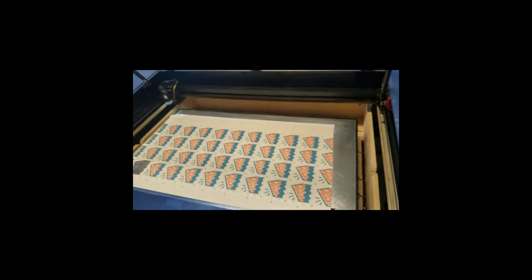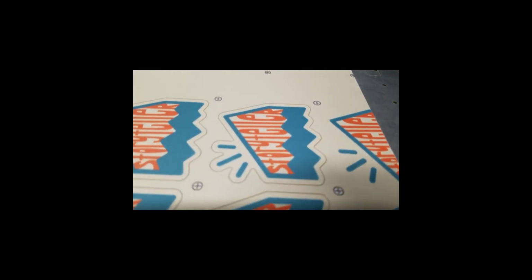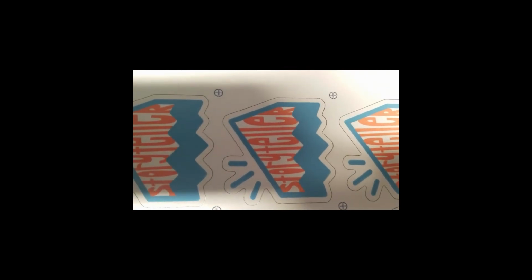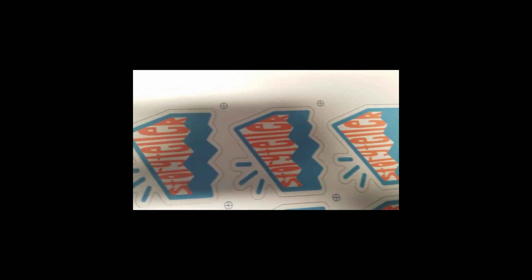Okay, we'll get some close-ups here. So let's look at the top right image, really close up, and look at that one. Get straight overhead on that letter. Okay, and then look at this bottom right image right there, and the image on the top left. Okay, and you can see they all look pretty much the same. So it shows that the distortion correction is linear all across the board, and everything in the middle will be corrected likewise.